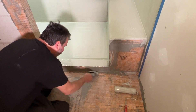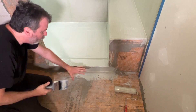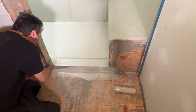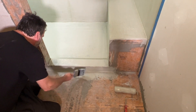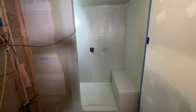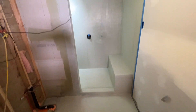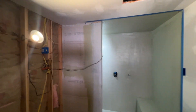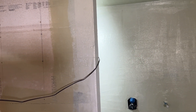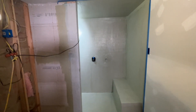This whole area outside the shower threshold is especially important to waterproof — this is where water usually runs out, rots the curb, and gets under the tile. Running the waterproofing out over the floor. That's coat number one. Let this dry a few hours, then coat number two. You can tell when it's dry — it turns a darker, almost olive color. Where it got sucked into the cement board a little, that's drying out quicker.